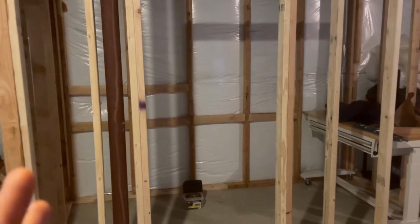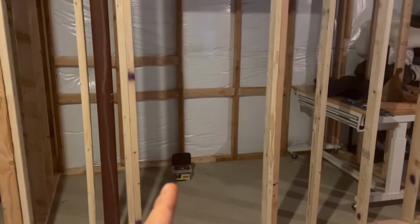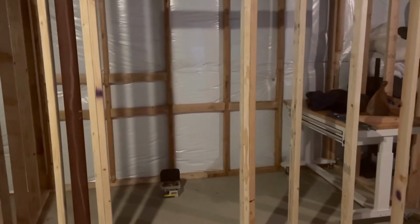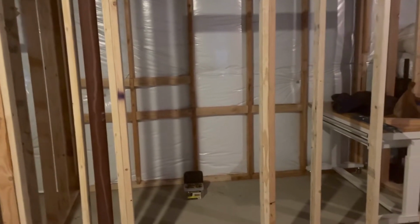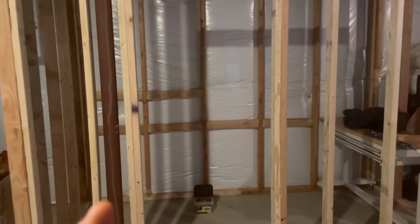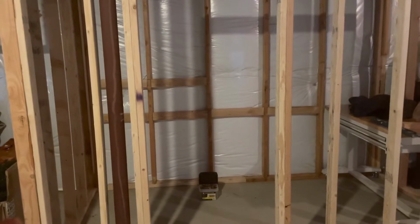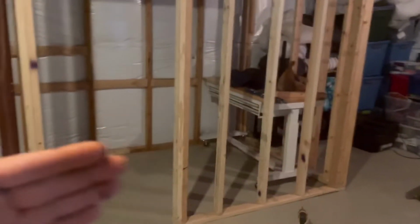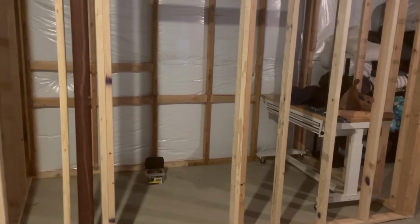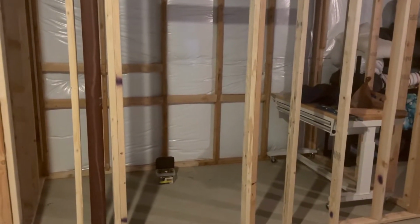It came out at $17, so we spent $17 on lumber, $36 on some screws, because I didn't want to use nails. I just used those gold 3-inch screws. And that's all we spent now. I bought 4 sheets of drywall. Those were $12 each. Again, I'm not going to drywall this whole thing out, because at least on this exterior wall right here, I am going to do 1/2-inch OSB to give it that extra security, and also just so it's a little sturdier.